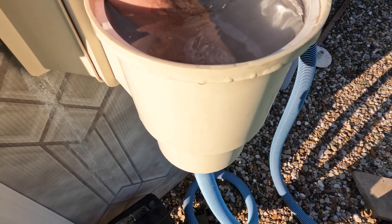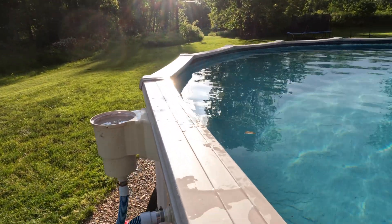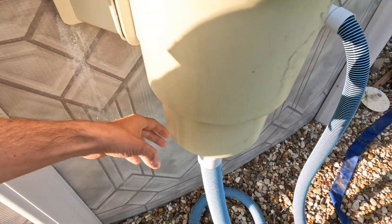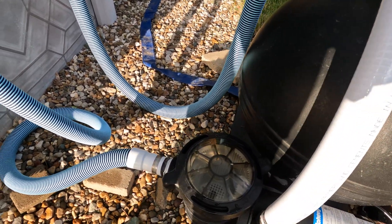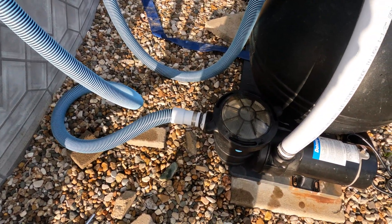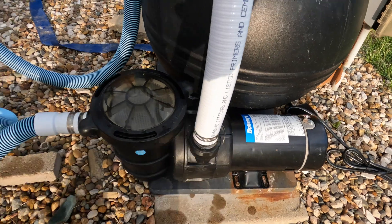Once that's tight, move to the inside. I had to unscrew that so I could get this bigger stopper in the hole. I've got that plugged so no water is entering in here, and I've got this one plugged from the inside so nothing's going to flow back out. Some water in the pipes will flow out, but now it's time to disconnect the lines and remove the pump.